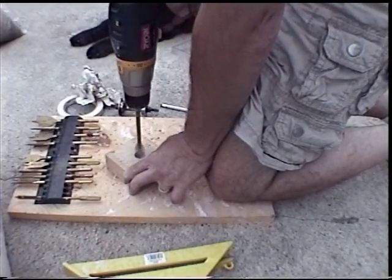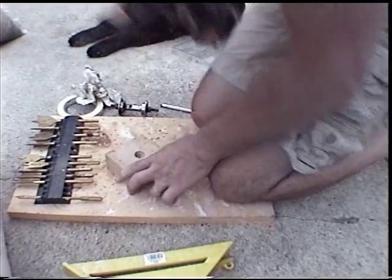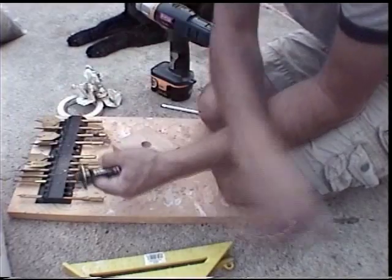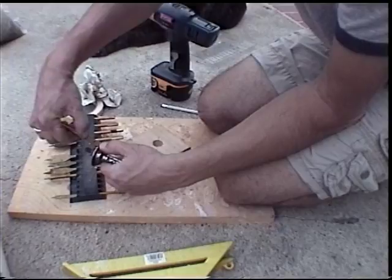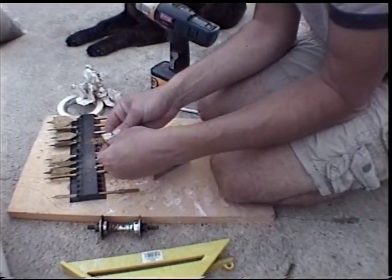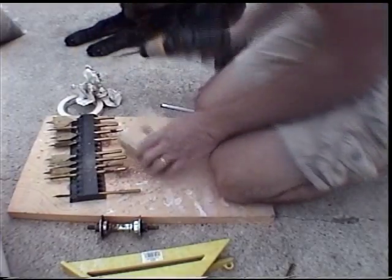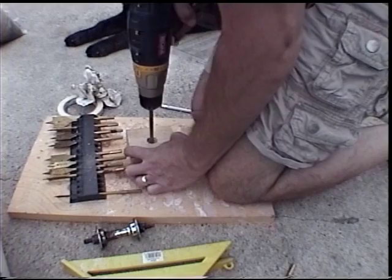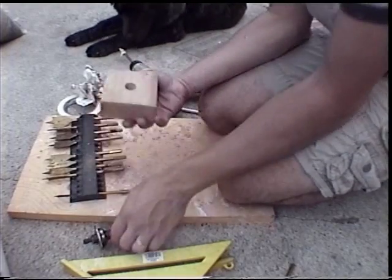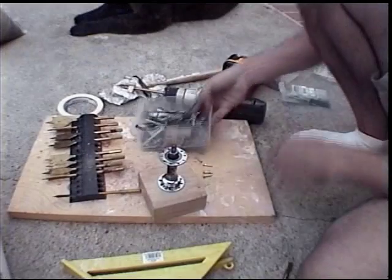Here I am marking the depth and drilling down as far as I can. Then I've got another hole saw — a smaller one — that is the thickness of the axle itself, a little bit thicker, so it will fit all the way through because the axle protrudes beyond the nut. I've got to go through all the way to the other side. And then you'll see right there it drops in. The axle needs to be centered in that hole to make sure it spins freely.